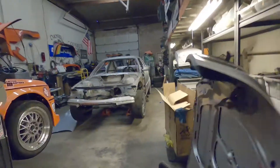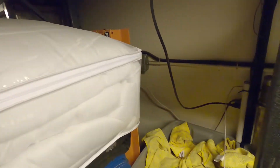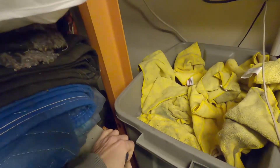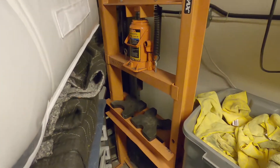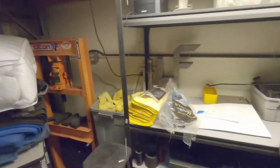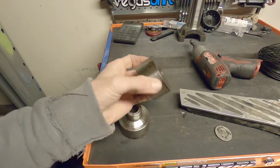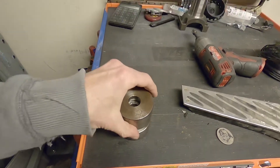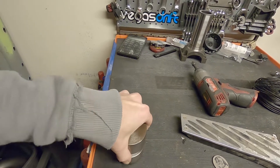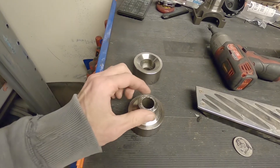Without the hole through the bolt, you will have to use a press. Just over here, hiding behind all this stuff — I think my wheel's locked — there we go. You'll need a press like this. These form those dimple die holes. You'll need to start by cutting a hole this size so the bolt slides through the center, and then you can start your dimple die.